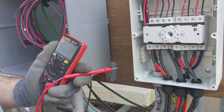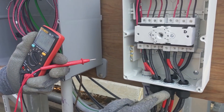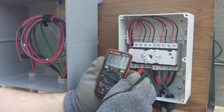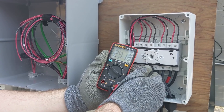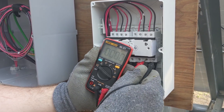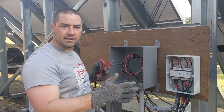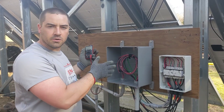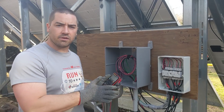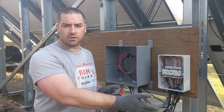These are the PV wires with insulation about three times as thick as standard THHN, held by strain reliefs with rubber grommets. Checking voltages: 294 volts and 291 volts on the strings with seven panels in series from the 14-panel array. The next two strings show 253 volts and 252 volts — those are from the 12-panel array split into two strings of six panels in series. That's why some strings read around 290 volts and others around 250 volts.